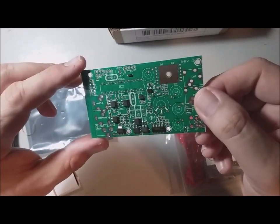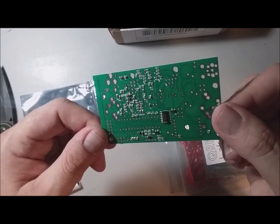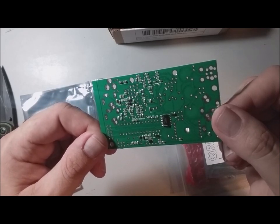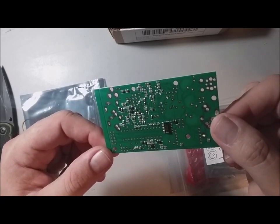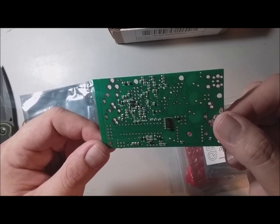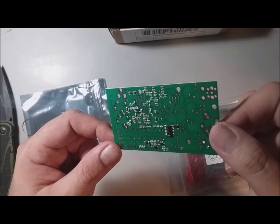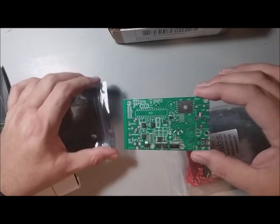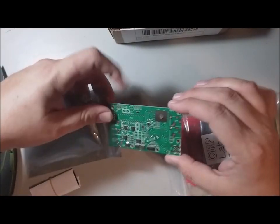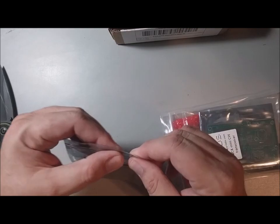You can see there are surface mount components front and back. In the manual, there are instructions on how to make sure you don't accidentally desolder any of them, and also how to do an inspection. I'll show how I do the inspection — I've got a magnified LED lamp that I'll link below. With so many components already installed, this build will probably go fairly quickly, since most of the resistors, capacitors, and ICs are already in.